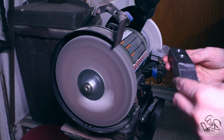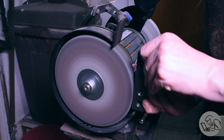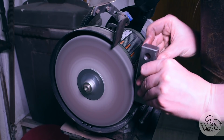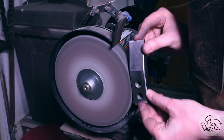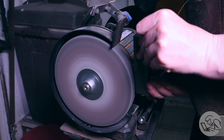To finish the surfaces now, over to the ScotchBrite wheel. A couple of those surfaces were unmachined, as I said, at the top of this video. So I'll just clean those all up on the ScotchBrite. And the ScotchBrite also takes out most of those tool marks that were annoying me a little bit on the sloped surfaces there. For finishing, I'm going to cold blue these. I think that'll look nice.